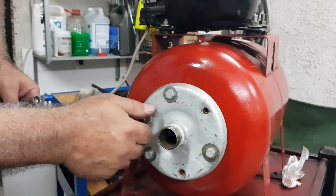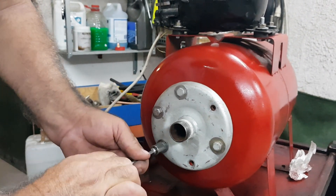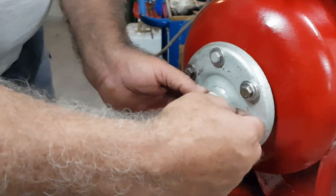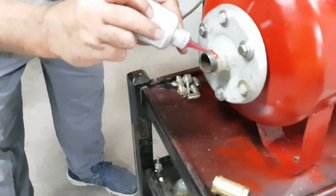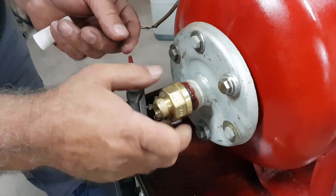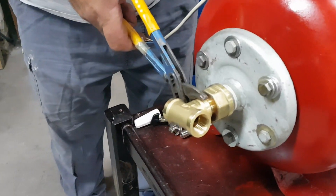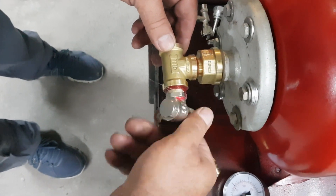On this tank the nozzle is detachable, so I put it back in its place. The next step is to join the couplings and connect the implements. We don't really care about the order we connect them — I have placed them this way because it was convenient for me. On the right side I placed the one-way valve and on the left side I put the pressure switch.